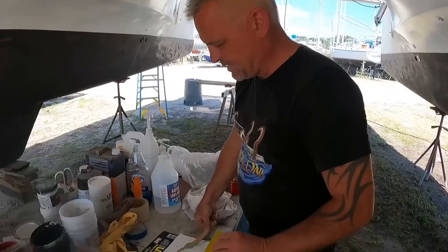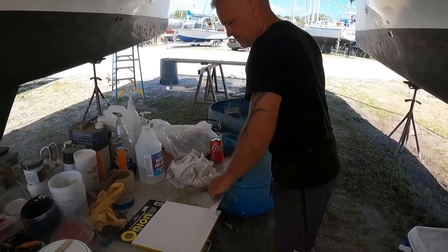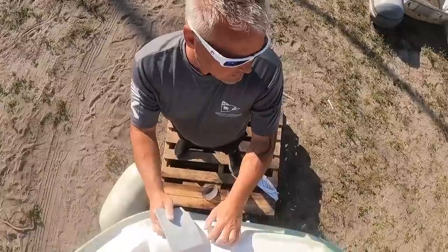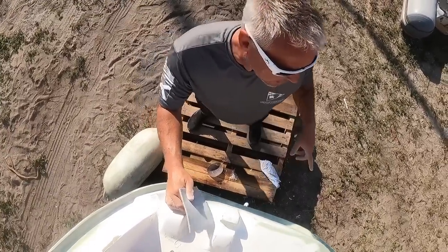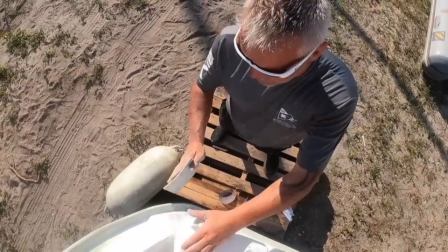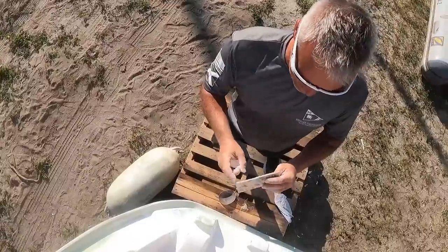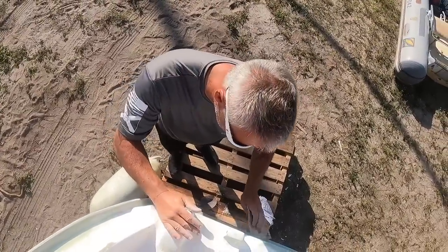So that was easy — super easy, and then super easy clean-up. We're back working on the sugar scoop today. The goal is to sand off some of the fairing, make it nice and flat, prime it, and paint it. So doing the touch-ups here, it's starting to look good. Back into sanding again — I had to put a little bit more touch-up of fairing filler on this corner; it was a little bit shallow. This foam sanding block is really, really good — I'm going to pick up a couple more of these. They're the go-to ones especially for getting into all these funny little areas.